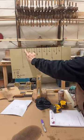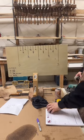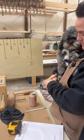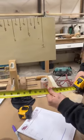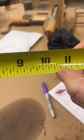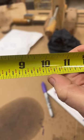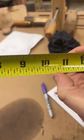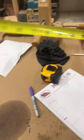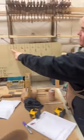Familiarize yourself that there are 16 parts to every inch. You can also get, like I said, one of these tapes that has these conveniently marked for you. So in every inch, you know, oh, there's my eighth, there's my quarter, there's my 3/8. And then the tiniest marks that aren't marked are all odd number 16ths. 1, 3, 5, 7, 9, 11, 13, and 15. Those are the only names of 16ths you will ever find. And see, I've named them here.